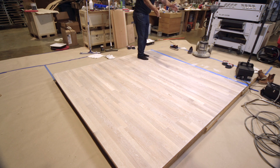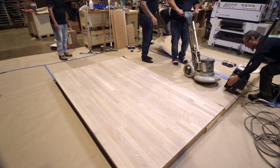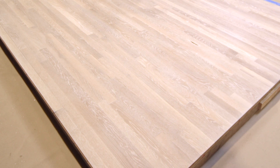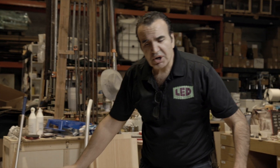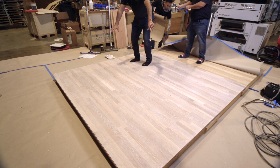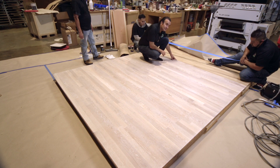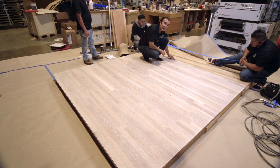Now I'm going to remove the tape and put a new tape right here. This is extremely important — with other methods like watercolor cerusing, people have to sand again and they can't connect the sections easily, because when you reach the end of the room and it dries, you get overlap issues. This oil gives you all the open time you need. I stopped right on the crack between pieces of wood — I didn't pass onto the next piece — and I stopped right here.